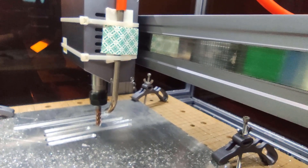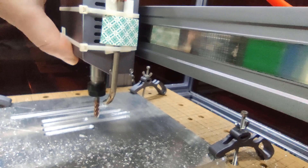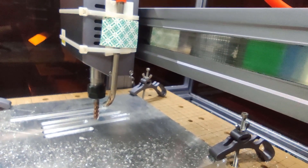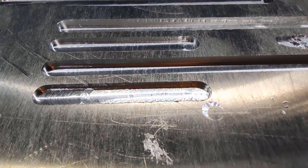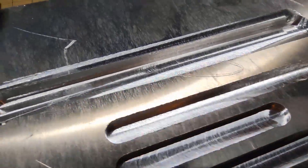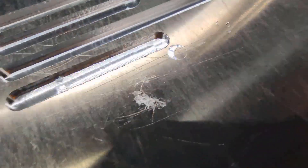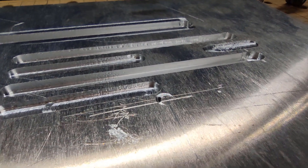I will try with a smaller tool, but I don't think it will be much better. There is a lot of movement in the machine and with that it starts hopping and you get no clean cut. It looks like the Snapmaker is not strong enough — we will have no good option to mill aluminium. If you like this video, please like and subscribe. If I get a new idea I will make more videos, but at this moment I think that is it.